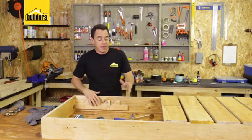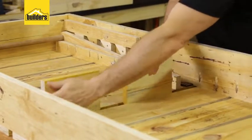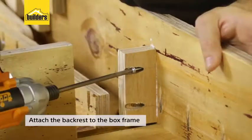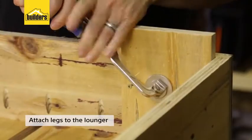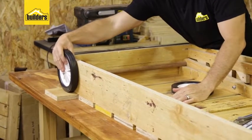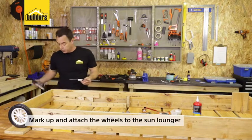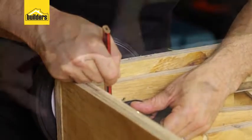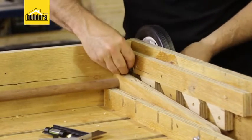I'm going to flip this over and put on our backrest. Remember where the two halves join, we want to keep the spacing consistent, so I'll put in my spacer. I'll put some wood glue on the mating surface and screw it down. Our hinges are in. Now let's put the legs on the far side and mount the holes for the wheels — I chose a 185mm leg because it's the same size as my wheels. I'll measure exactly where I want the centre hole: half the diameter is 92.5mm, and the wheel will overlap on the back by 40mm from the inside. I'll drill a 10mm hole and use a 10mm bolt to fasten the wheels to the frame.